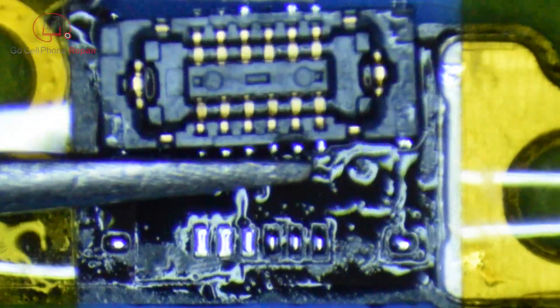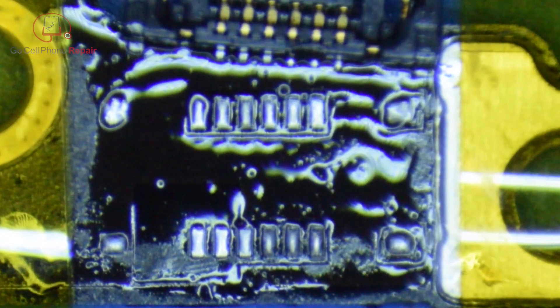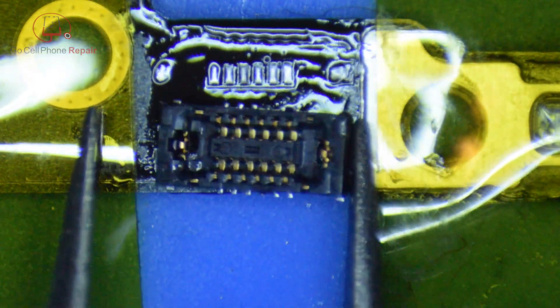The anchor points on the corners took a little more heat and a little more time to clean up. Now I'm going to come in with some hot air, with my tweezers at the ready. I'm just going to slide this over to the side as soon as I see the solder liquefy, which did not take very long — just a few seconds. That came off clean, and now we have a usable connector that we can put on the board that needs help.